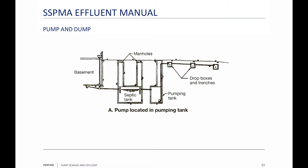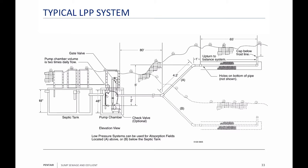There are two types of systems that use a pump. A pump-and-dump system has drop boxes — it fills the system and lets gravity take over, so you don't want to pressurize it. A low pipe pressure system does not use drop boxes; it pressurizes the system and forces water out through the laterals. System A means you're pumping the water up; System B means pumping it down. Know your local codes for burial depth.